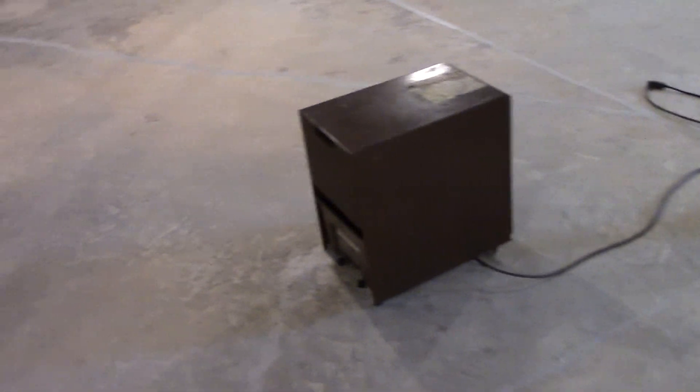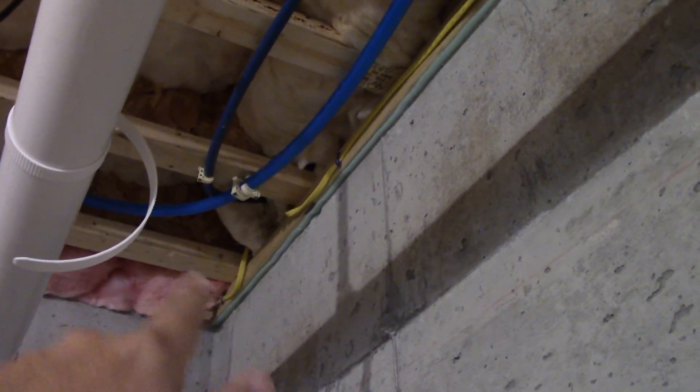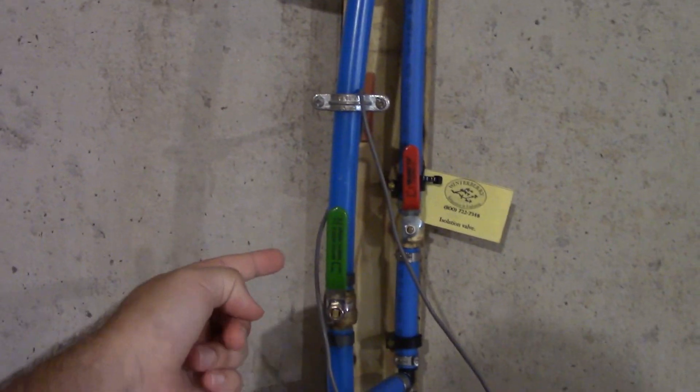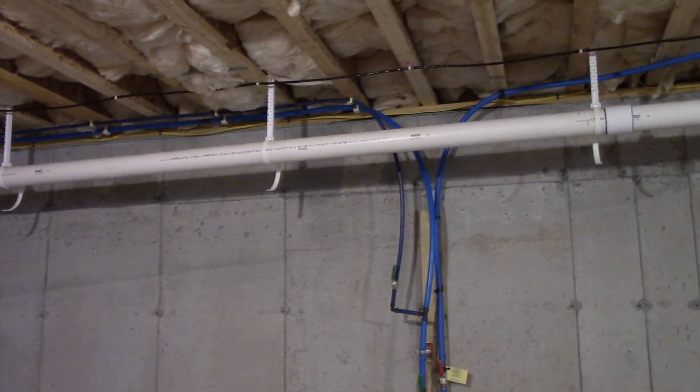The dehumidifier is doing great - I emptied the pan yesterday and it's been running since. Over here is where the plumber tapped into the PEX lines for that hose spigot - you can see he tapped in right here. This is a shut-off valve for the winter. That hole was already drilled but they just put the stone over it, so the guy drilled right through, ran the line through, and connected the hose spigot - it's working beautifully. That cost wasn't on my parents, so that's very good. One thing I like is that while he was at it, he made all the valves face forward now, which is a much better way to have them. You can see it just tees off right there.